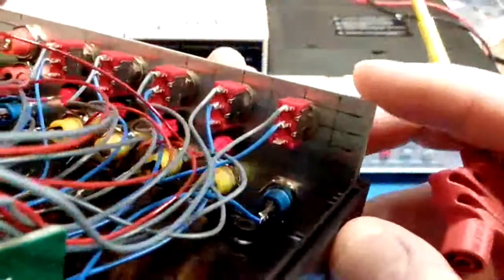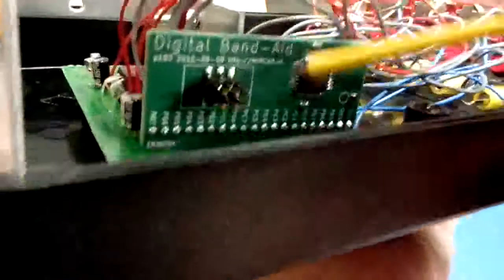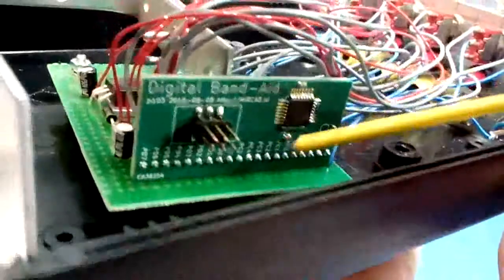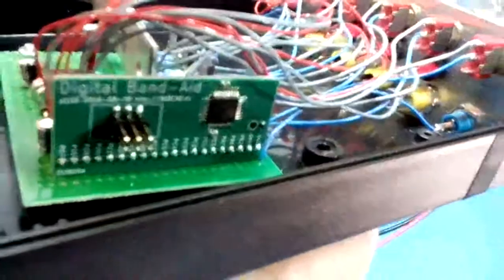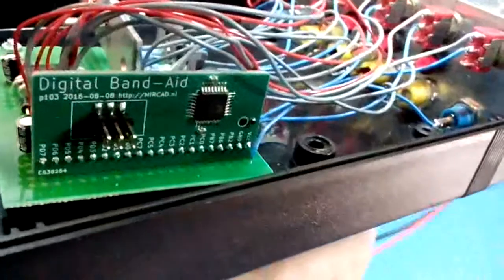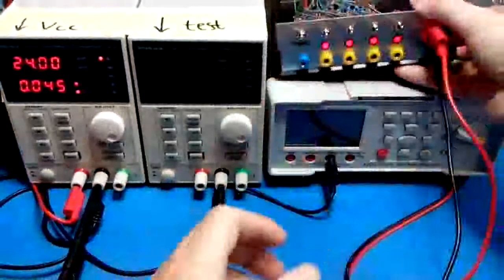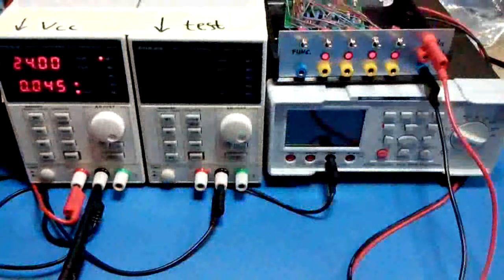It's just an aluminium plate with holes drilled in it. Switches and LEDs, as you can see, and 4mm terminals. And also, there's a homemade general purpose microcontroller on a board, and it basically does the switch debouncing, and the logic of the function switch, the behavior of the function switch within this box. So that's that. Now let's leave this thing right there and go back to the schematic briefly.